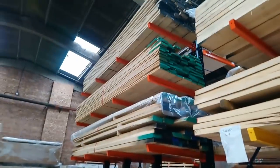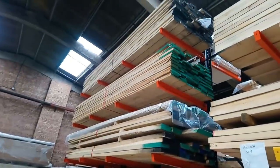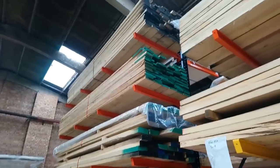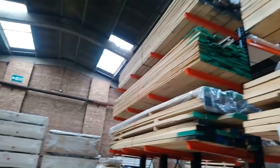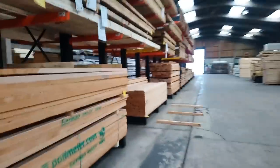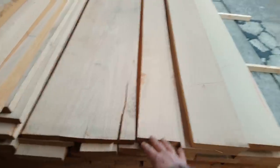I could use tulip, but I prefer the finish on beech - it's slightly smoother. That's the tulip up there. I don't know, 3x6 or 4x2s - I need two-by-something for the doors so there'd be a lot of waste in that. They look like slightly wider boards so I'd probably get two out of each, but it'd be a lot of waste, so back to the beech. A lot of these are too narrow for what I want.